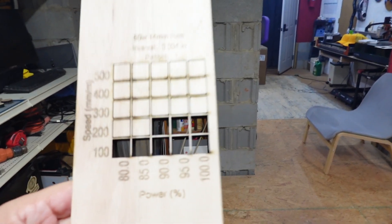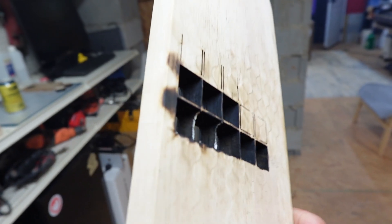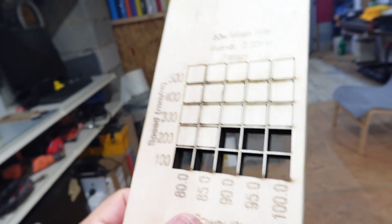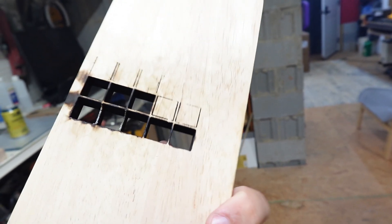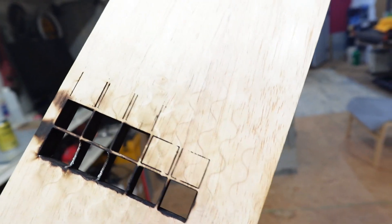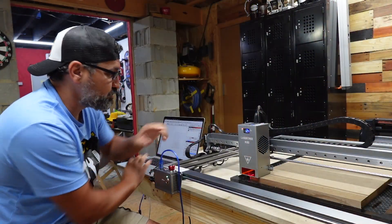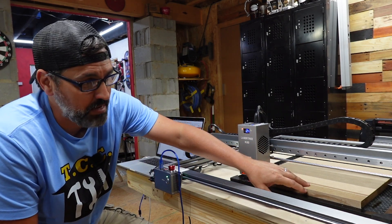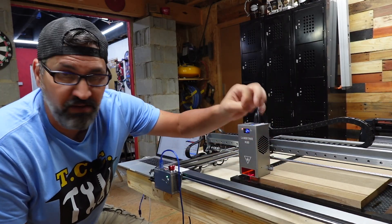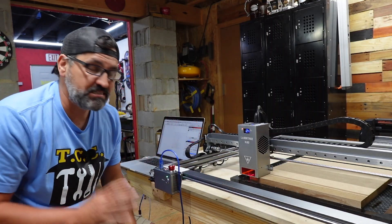Check it out — that is the 14 millimeter pine single pass cuts. It just sliced right through it. It almost made it at 300 millimeters per minute, though some of it burnt really crazily on the back. You can see it kind of fried the back of that cutting board. So our settings are 400 millimeters per minute at 90% power, and we're going to do three passes on this MDF. It's three quarter inch, so we'll see how it does. If anything doesn't drop through, I'll just do one more pass without moving anything. Let's send this to the machine and frame it.